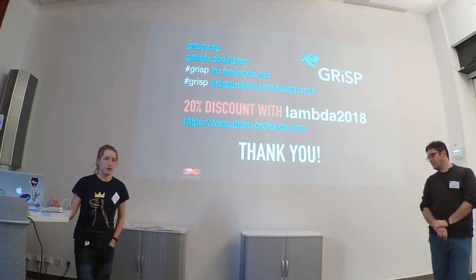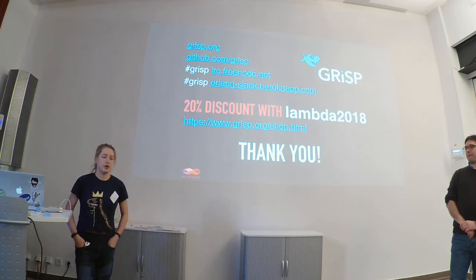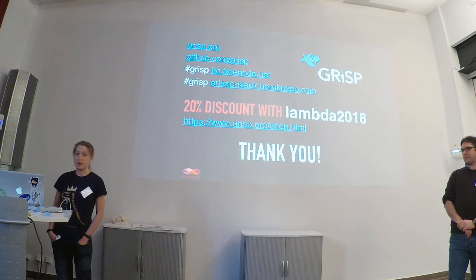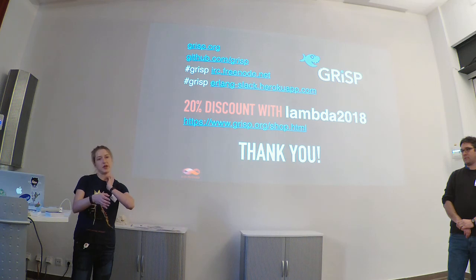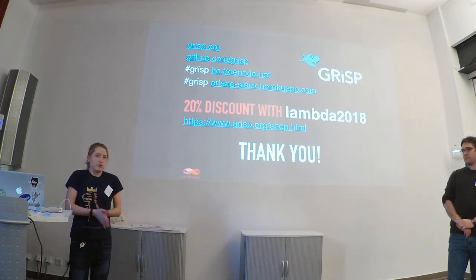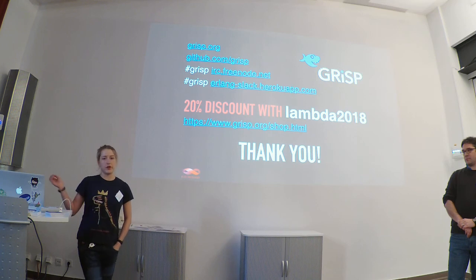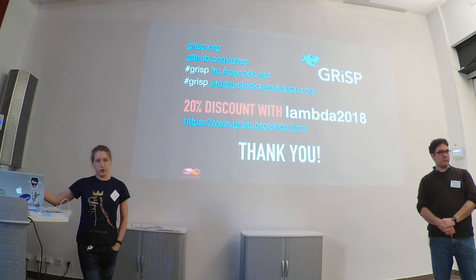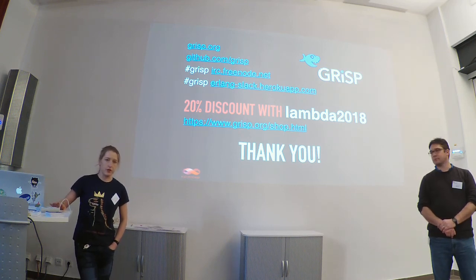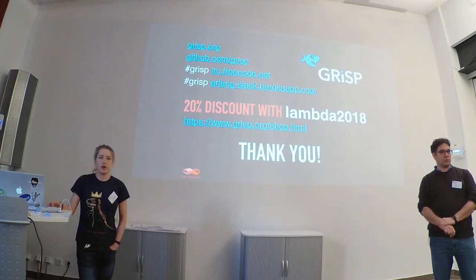So what you would do is get this board, plug in all the devices or peripherals that you want, write a program, and then once you settle down with the code base and everything else, you write to some factory and say, I need the board with this and this specification, and with this system already fused into the board itself. Then you mass produce those boards if you want to really go into production. This is rather a prototyping board where you have great flexibility.